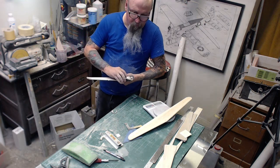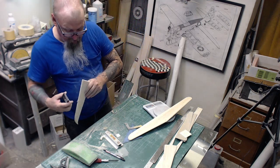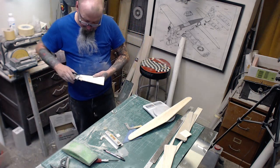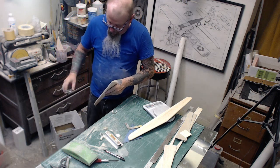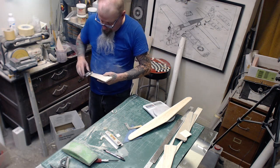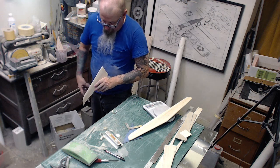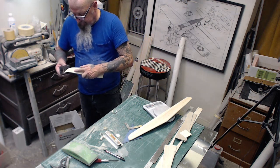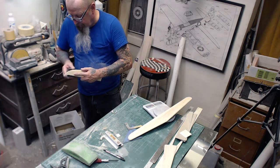You'll notice though, even though this plane is set at 15 thousandths or 10 thousandths or whatever it is, it's not very much. It does not take much to do the job when it's set like that. If you set it at 1/16 of an inch or 32nd of an inch or what have you, it makes it very difficult to operate the plane.